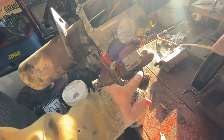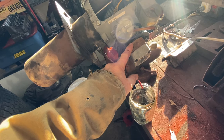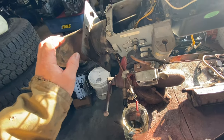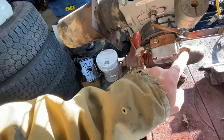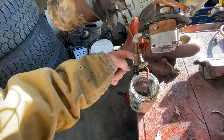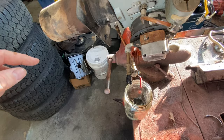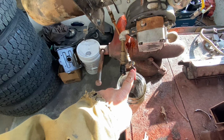As a quick synopsis: oil is coming in here, there's a pre-filter here, this is your standard Beckett pump pressurizing the oil. Under a normal scenario that would pressurize the oil into the nozzle the existing Beckett burner comes with - which wouldn't have any preheater or air injection. In this setup, it's coming in down here, going to a small screen, pressurized, coming out here. In my scenario I have it going to a T where I can siphon off whatever amount I wish up to the nozzle. The remaining returns back to my holding tank or preheat tank, continuously loops, and comes back in again. This ball valve is really the key to your flame's intensity.